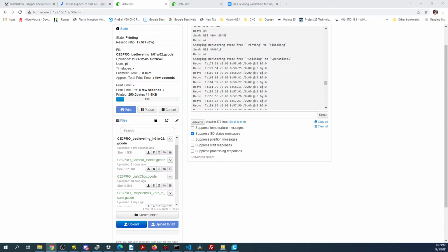For the ramps, let's see, is there a possible way to continue where you left off with Arduino Mega ramps during a power loss situation? You need a way to save the actual last thing sent. There are tools they make for other printers. This one I'm not sure of, but for the SKRs, there's a way to do it where you can maintain the memory on the actual board with an external power supply, like a tiny UPS.